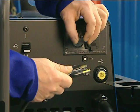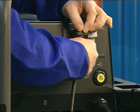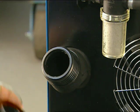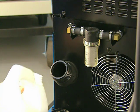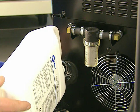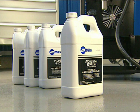The cooler power source plugs into the receptacle at the right top corner of the machine. Next, add low conductivity Miller TIG coolant. The reservoir holds 3.5 gallons. The coolant level should be checked weekly — top it off with distilled or deionized water if necessary. You'll need to replace the coolant every 12 months.